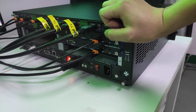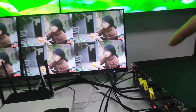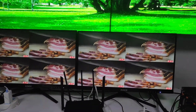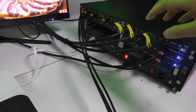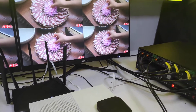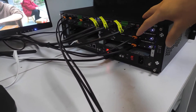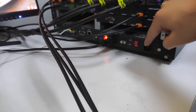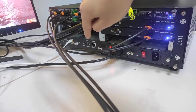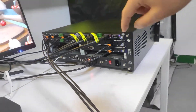There is also an RS-232 port which we can use to send commands to change the resolution or change the working modes. We have two slim HDMI cables connected to two monitors on this side, and on each monitor we can see four windows displayed. This matrix switcher also has a white cable connected to a Wi-Fi router, so we can use an iPad to control the whole system. This AFM modular matrix switcher will have a redundant power supply, RS-232, and LAN port for TCP/IP control, plus a backup control option.